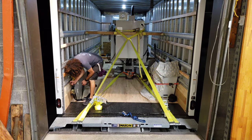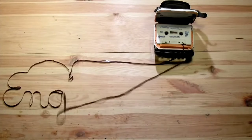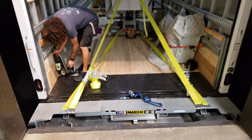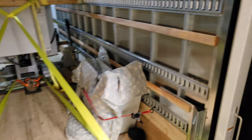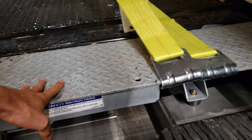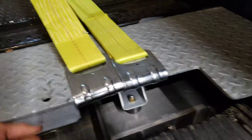The Haas tool room mill arriving as we transported it in the box truck. The box truck was difficult to strap down because it has these e-tracks on the side, but the e-tracks are just attached into sheet metal which is not that thick and the whole side is bendy. So we wouldn't really trust those e-tracks for heavy loads like this. We found that this plate right back here, part of the tailgate and lift gate, has heavy duty quarter-inch thick steel and it's pretty well reinforced.